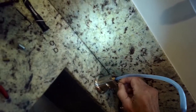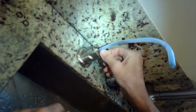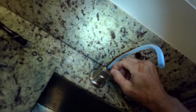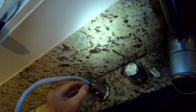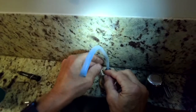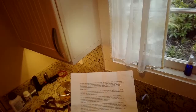You want to leave the barrel — which looks like an elongated barrel — so that on the hot and cold side it's not all the way down as far as it can go, but maybe a sixteenth of an inch gap between the bottom of that brass barrel and the valve stem. That's going to give you room to be able to slide those levers back on. You may need to do this procedure a couple of times to get the adjustment just right on how far those brass barrels go down on the stem.